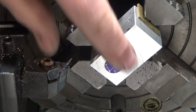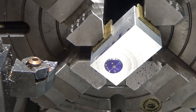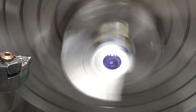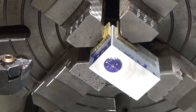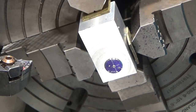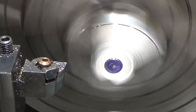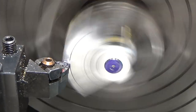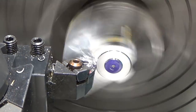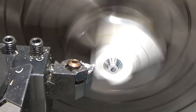Here's what we have after the first pass — actually a pretty nice finish. We're going to go in another 25 thousandths or so and do the same thing. Let's try one speed faster — 300 RPM. Let me change the feed rate too: that was 2.2 thousandths per revolution, and we're going to shoot for 9 to 10 thousandths per revolution. All those layout marks I put on there are all gone — hilarious. Getting closer, a couple more passes.